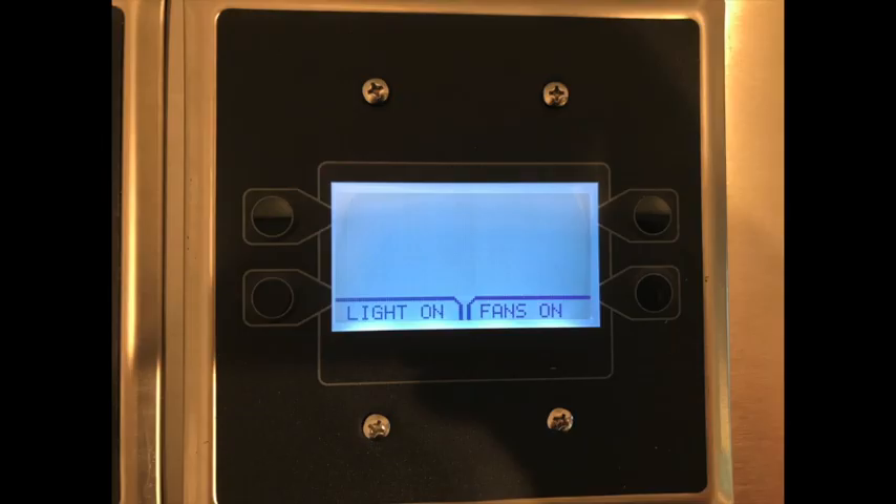This video applies to software versions of 2.0 or higher. The software version is displayed on the circuit board display in the control package. Faults will appear on the display on the front of the hood or on the door of the control package. This display is also called the HMI. The fault will flash on the HMI and the HMI will give an audible alarm that can be muted by pressing the mute button.